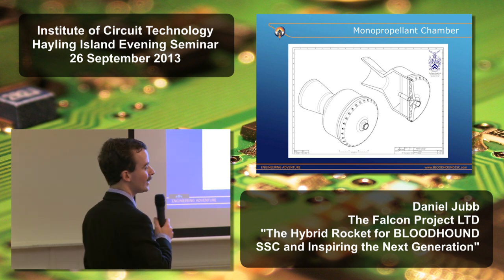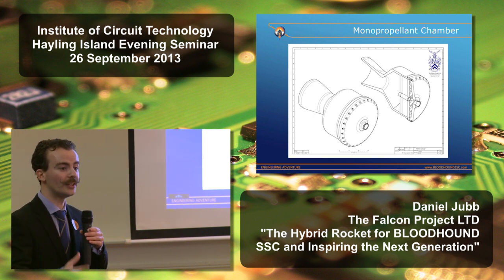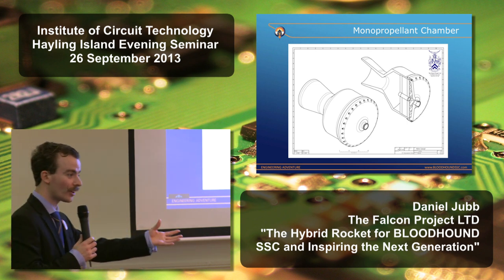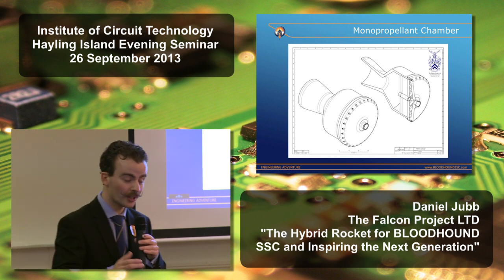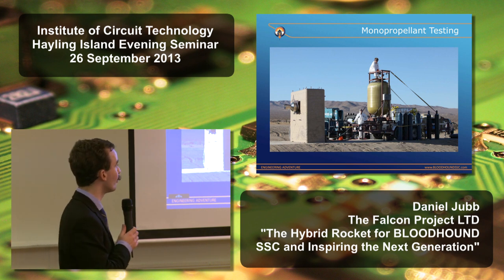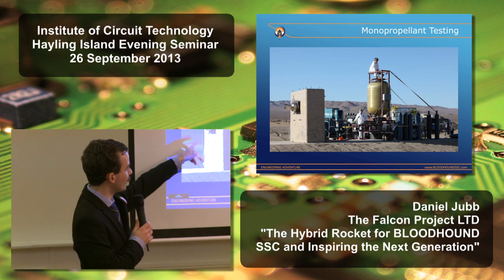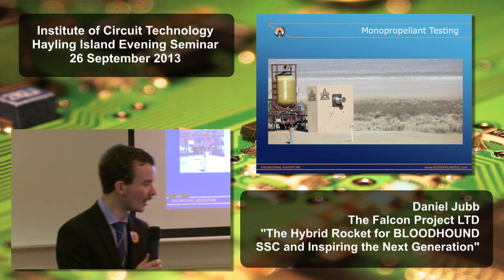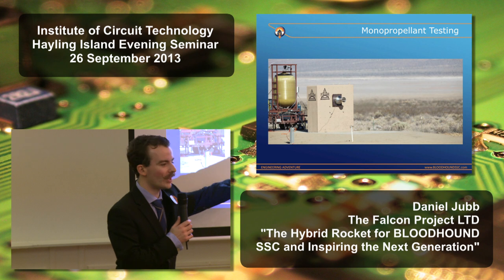The first thing that we actually tested was a thing called a monopropellant chamber. One of the other advantages of HTP is that you don't actually need combustion to generate thrust. You can just pass HTP over that catalyst pack, generate superheated steam and oxygen, expand that through a nozzle, and you can get about 10,000 pounds of thrust. Probably enough in conjunction with the EJ200 to get the car to about 800 miles an hour before we have to bring in the hybrid. Before we had access to our HTP pump and engine, we tested this in the US using nitrogen to pressurize a HTP tank. And when it's running, well, there's not really an awful lot to see. The decomposition's so clear that you can just about make out the heat haze.